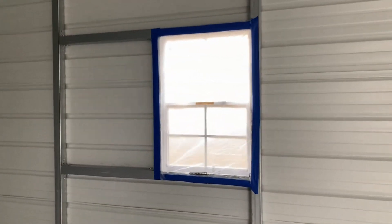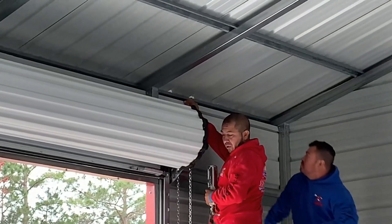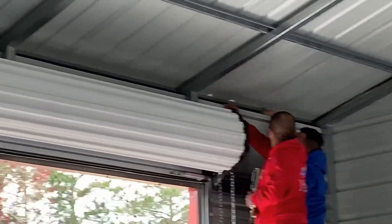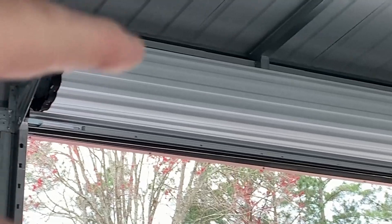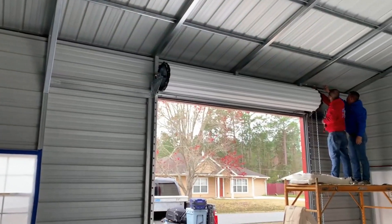To make everything good, they're going to tape everything up. We're going to be putting plastic over all the windows and all the stuff where we don't want foam to get on. They're going to close in the little gaps on the ceiling, and we're going to put some fiberglass up there so we don't fill up this gap in the eave, because that's going to take up a lot of product. I don't want to be paying for extra product, even though I'll have a flat rate price. We don't want to be hit with any surprise bills at the end.